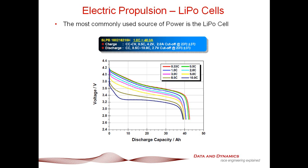A couple of words of caution about LiPos. LiPos give you great energy density — but there are a couple of don'ts that you do not, under any circumstances, do with LiPos. Number one: you don't puncture the cells. You do that, you are playing with fire. Number two: you never discharge a LiPo cell down to 100 percent capacity. You always take a LiPo to 80 to 85 percent. If you go beyond that, you're playing with fire. I have learned that lesson the hard way, so there's no need for you to repeat my mistakes.